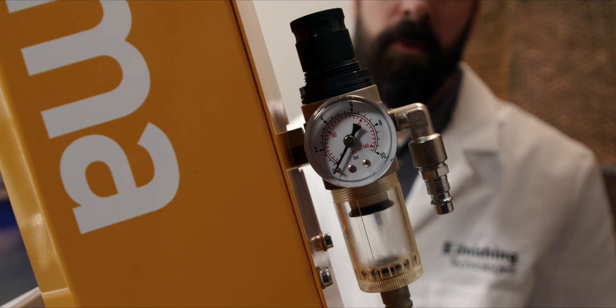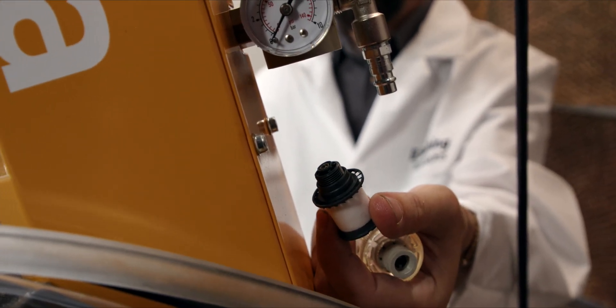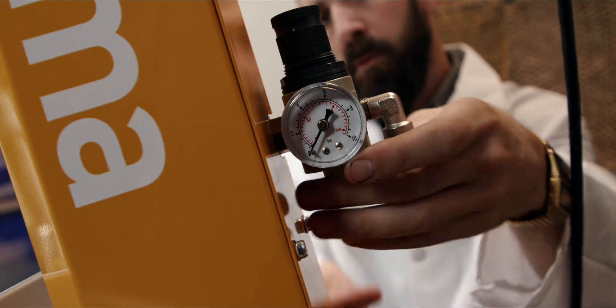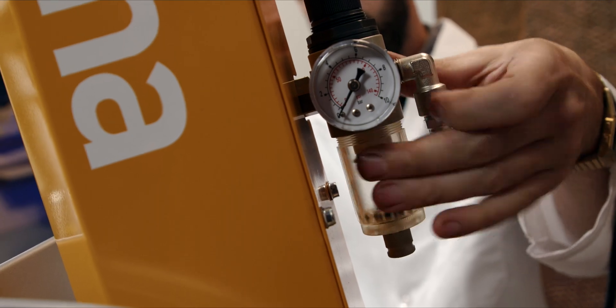As far as wear parts for the manual box feed units go, let's start at the beginning. The air regulator on the back of the unit has a filter element in it. This is important because the quality of your air definitely affects your coating's finish quality out the other end. Clean dry air is critical for any finishing equipment. How often you need to replace this depends on your shop air quality. You may simply wait for when this filter turns pink or yellow, but we recommend preventatively replacing this at least once a year.